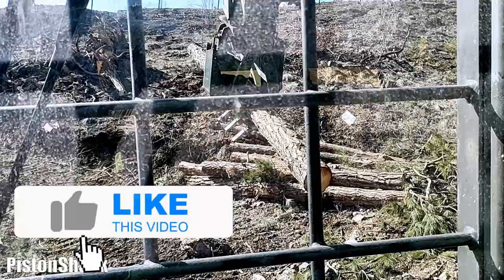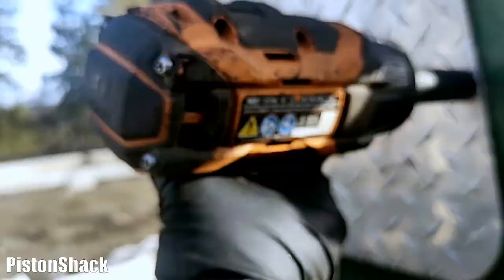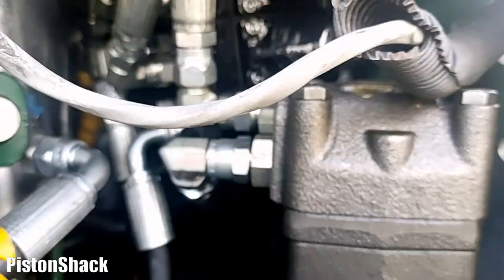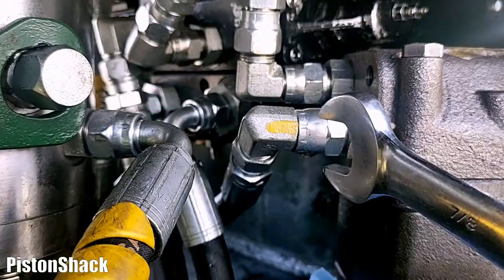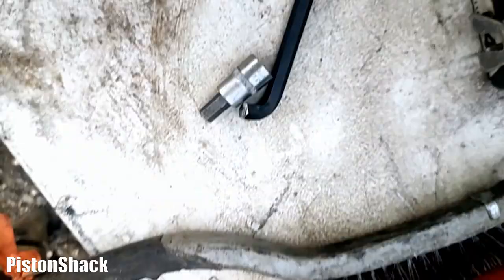Let's start taking it apart. We'll take the covering plate on the side of the power clamp — actually, we're going to take the cover on both sides to access the axis inside. This is one of the rotator motors. Let's take the cover from the other side, mark the hydraulic lines — at least one of them — to make sure we put them back in the proper position. Disconnect the hydraulic lines, and before disconnecting, relieve the pressure in your hydraulic system.